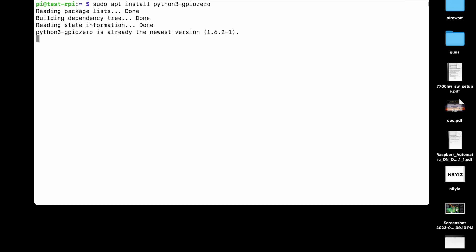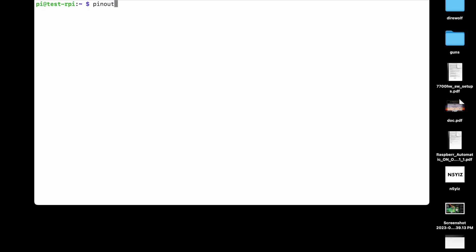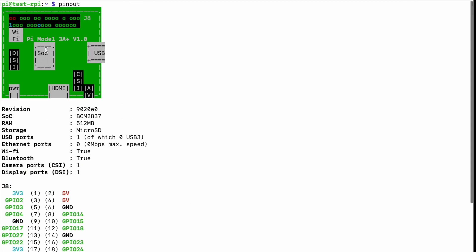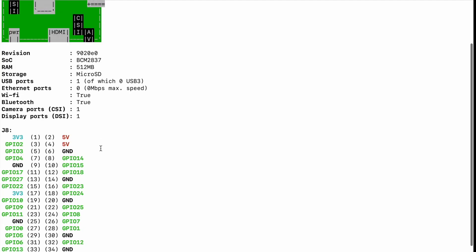When you install that and type pinout, you should get some type of return. Let's have a look at this pinout. When you type pinout, first thing you're going to see is basically a layout of your Raspberry Pi. This up here depicts a layout of the header pins. The 1 is pin number 1 — you've got 20 pins here for this particular Pi, and then 20 on the top, with pin 40 being the complete opposite of pin 1. Those are the two we're concerned about.